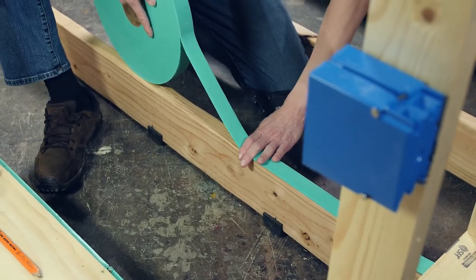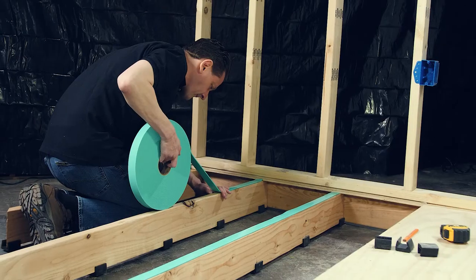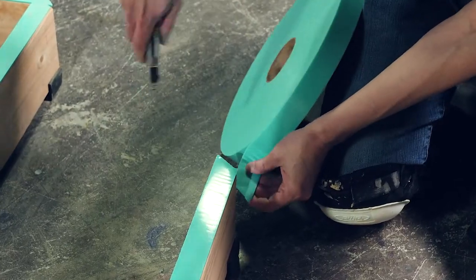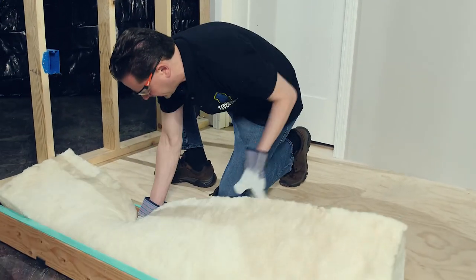This step can also be done for any subfloor that is being installed over joists. It is inexpensive, it is simple, and yes, it is very effective. Joist gasket tape. Apply gasket tape to each floor joist to dampen impact sound and eliminate floor squeaks. Joist tape can be used with or without joist isolators. They can also be used on wall and ceiling joists before you apply sheetrock or plywood. For best results, install unfaced insulation between joists.